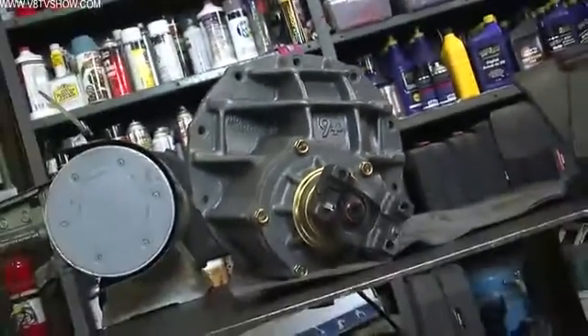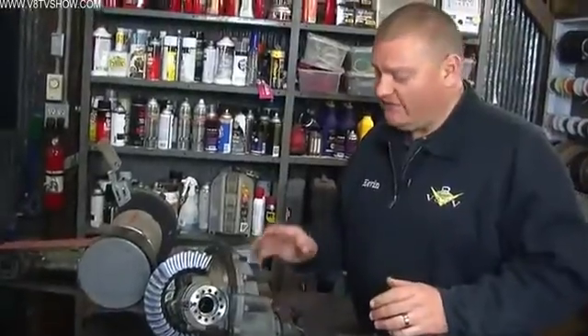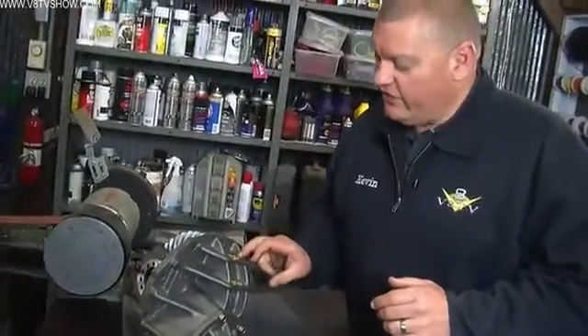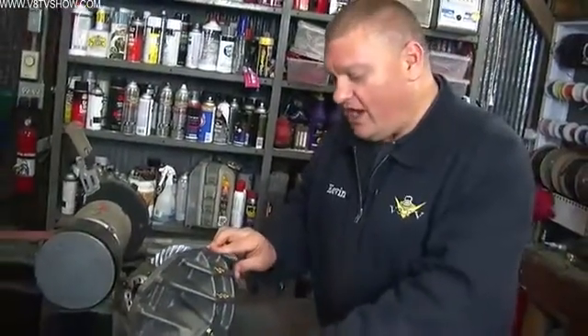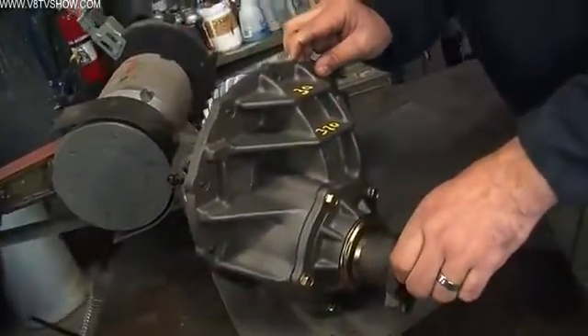Interestingly, the nodular case versus the stock gray iron case — the main difference is the original stuff is actually more brittle. You've seen broken cast iron: you can take a sledgehammer and smash it and a big piece will fly right off. It's very strong but has no elasticity. Nodular iron has graphite inclusions in the cast which makes it flexible and resilient, so when you apply all that power to it, it will shift and come back into its original position rather than explode and shatter like the rigid stock iron.